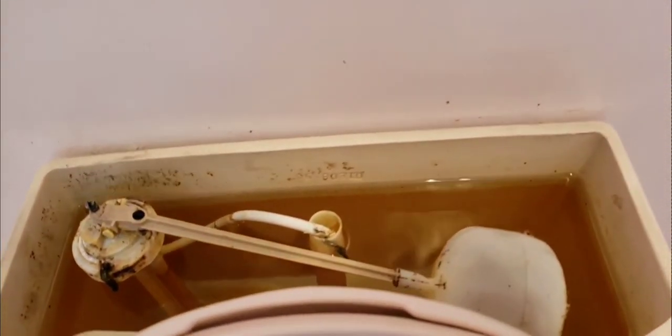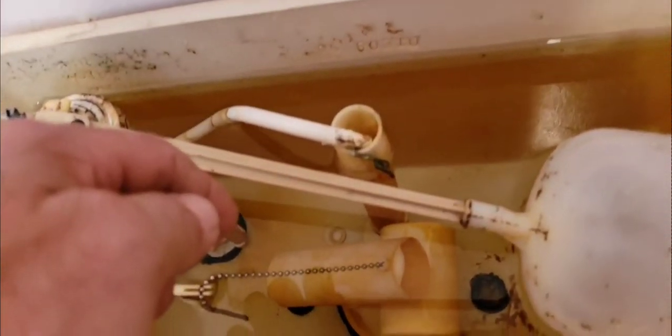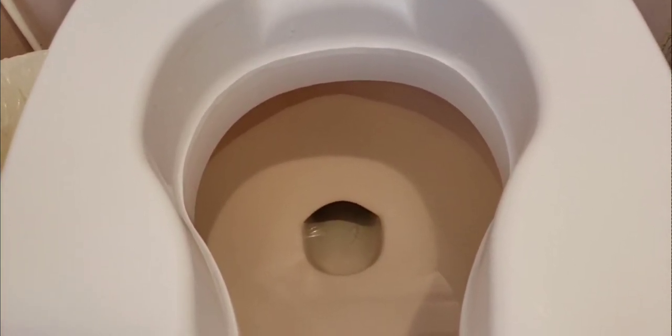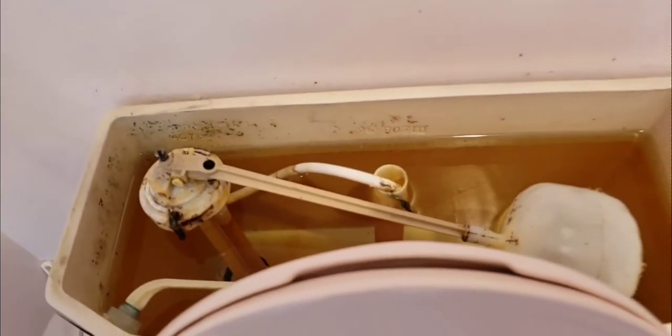We might not mess with the old components anymore because they're too old. Once you start moving them around, if they're old they'll crack down low and then you'll have a continual leaking into the bowl, and you'll be tricked into thinking it's the actual flapper. But I do not see a flapper issue going on here — there are no drips showing on the edges of the water. So we will replace the fill valve.